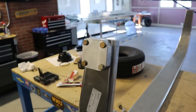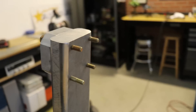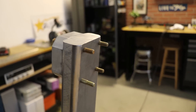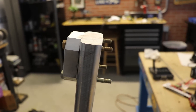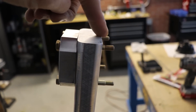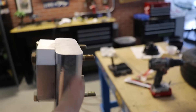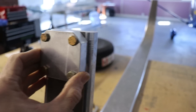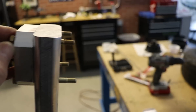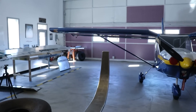I have just finished drilling these four holes in the main gear. This is something I've been dreading doing for a while, because if you screw this up, it's going to be expensive to replace that gear. It's really thick aluminum — looks like about an inch or an inch and an eighth — and you have to match drill the holes from this spacer. I've done these four here and just put some random bolts in there to keep it aligned. So that's done, and now I'll do the same thing on the other side.